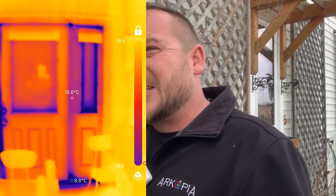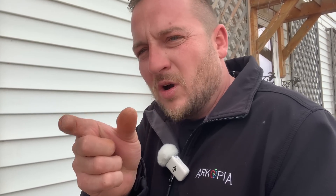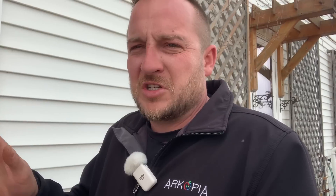On the front of my house I put a manufactured door with a little side light on the sides. That side light is the most inefficient part of the whole thing. The steel door has a screen door with an air gap, and on the thermal imager I can clearly see I'm losing much less heat because of that double-double door system — just a screen door and then your standard door. But the side lights are sucking heat out of my house because it's just the thickness of door insulation. I'd never buy a manufactured door with side lights again because of the inefficiency.